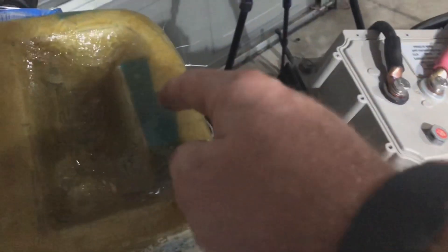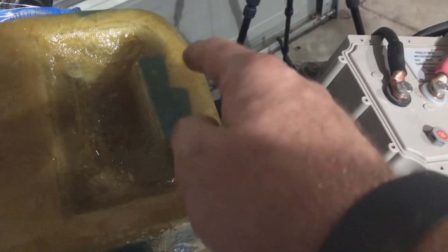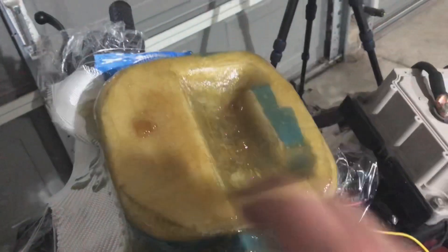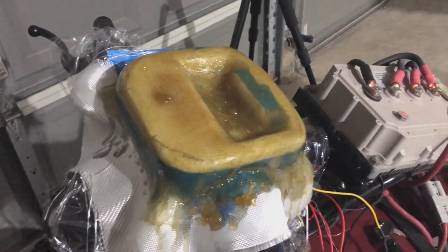Below that we'll have battery temperature, and I have a battery temperature gauge with a probe inserted into the battery pack. We'll put that right here. We'll have the volt and amp meter up here as well. Both of those will be powered when the key switch comes on — the display will come on, and those two gauges will also come on.